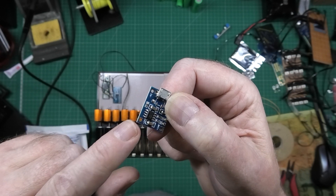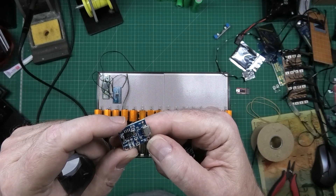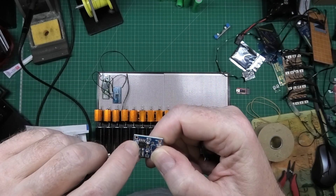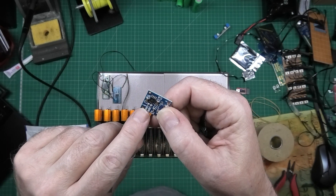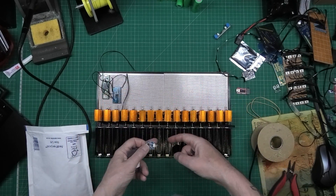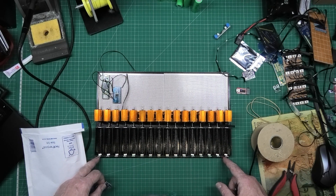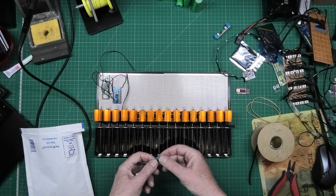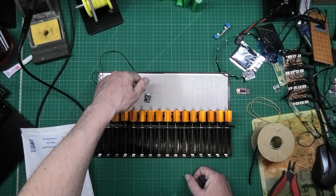That there is the controller IC which does all the voltage sensing and everything else, and it's got a built-in cutout MOSFET purely to stop the charge when it's full, and two LEDs - one red, one green. Because these are all single cells, they're not in series and not really in parallel either, although the negative is linked. I can use these somewhere somehow.